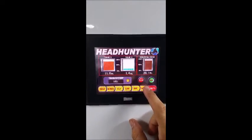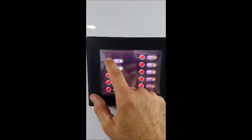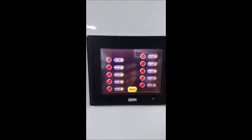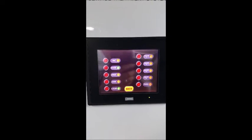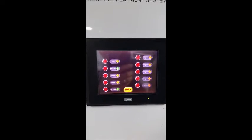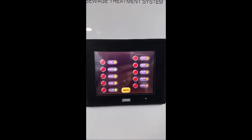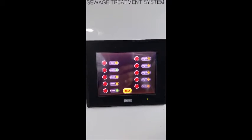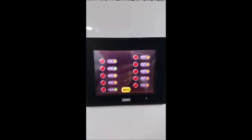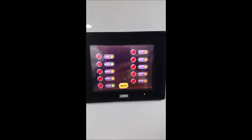If we go here to the hand page, this is a nice function. This allows you to hand run each of the pumps and each of the components on the machine. It's good for diagnosing — you can run each component and see if it works. Also if you've been hauled out of the water or the machine's been down for a while, you can go through and run every component before you fire the machine up and make sure all your components are functioning before you fire the whole system up. That's a very nice function.